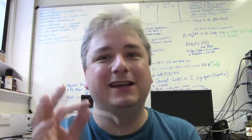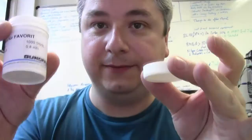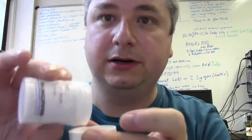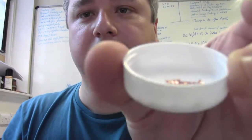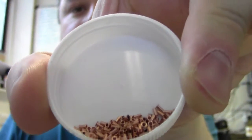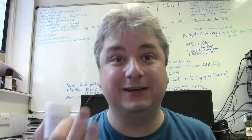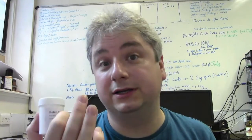The disadvantage of riveting is it's a very very long process. So this is the copper rivet that goes into the hole of your PCB. Again, you can only buy them in certain diameters — they have an external diameter and an internal diameter. The external one has to match your hole diameter, and the internal one has to be large enough for the component lead you're putting through the hole.